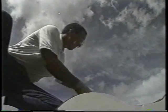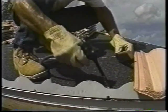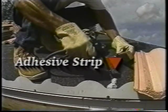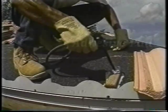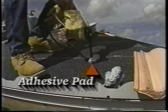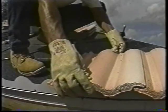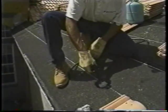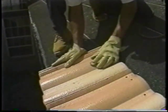The medium-profile tile installation also uses a metal eave closure. Refer to the operating instructions for installation with a raised fascia. Like low-profile tile installation, Tile Bond adhesive pads are 1½ inches wide by 4 inches long by 1 inch high, except for the first pad of each tile in the first course. Apply a ½ inch wide by 6 inch long adhesive strip to the cap sheet at the butt of tile under the pan on the overlock side. Place a 1½ inch high by 2 inch wide by 6 inch long pressure-treated wood starter strip into the adhesive. Dispense a larger 1½ inch wide by 6 inch long by 1 inch high pad directly onto the wood starter strip. Don't block the drainage holes. Apply the second pad about 1½ inches wide by 4 inches long by 1 inch high directly onto the cap sheet, diagonally across from the first pad. Be sure that the anchor lug and pan portion are embedded in the adhesive.